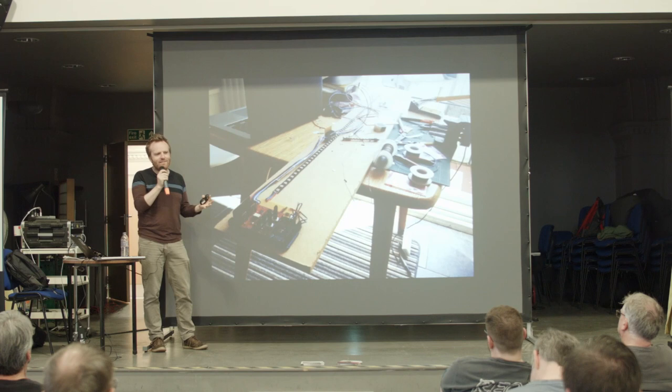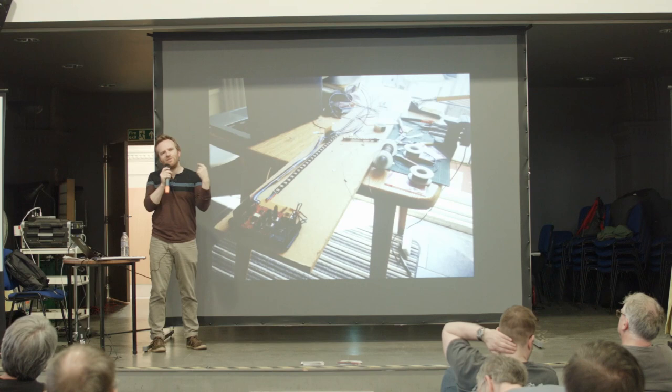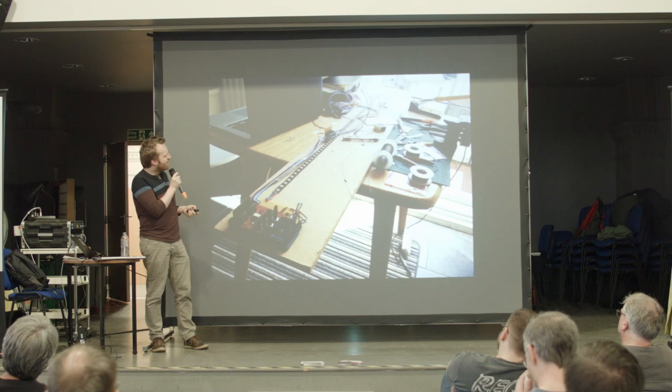And so I bought some strips that were 74 pixels per meter, just to see the sort of spacing. So I thought for each note I could use four pixels wide and one pixel in between each note. So I just tried that to see how many notes I'd get, how big the keyboard would be,